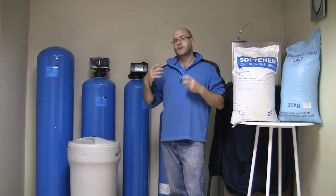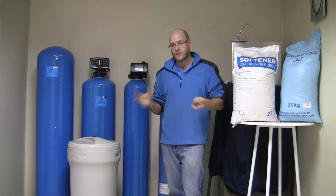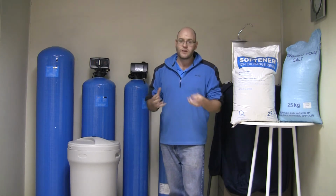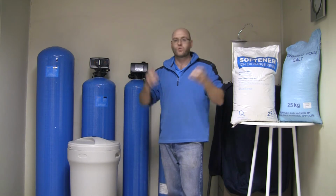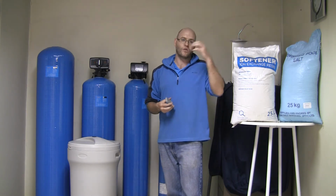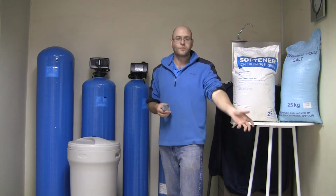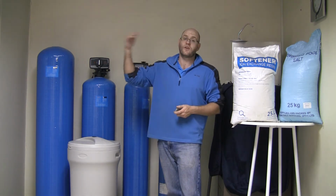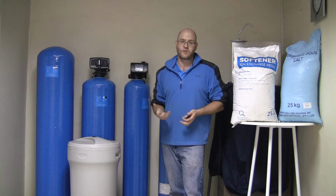This is why we recommend that one of the first things you should do before you purchase any softener is to have your water tested. The parts per million of hardness are always going to be different from source water to source water. You have some boreholes or municipal waters that have 30 parts per million, you don't even need to worry about softening them. You have others where you're going 300, 500 parts per million and softening is required.